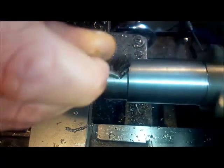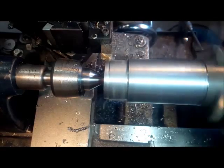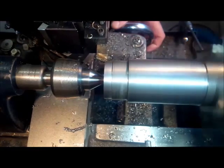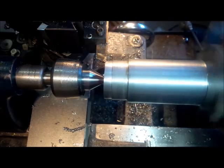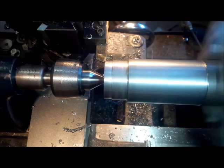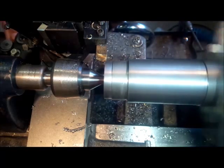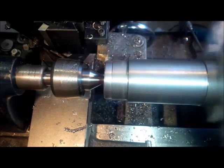No lube — let's get a little cutting oil on there. I'm not using coolant. So that's 25 thou; let's back that out and add another 25. Then we'll go through that other 25 we did — 10, 20, 25 — and see if we get there. Another 25.